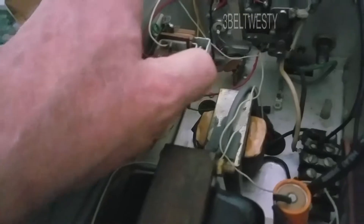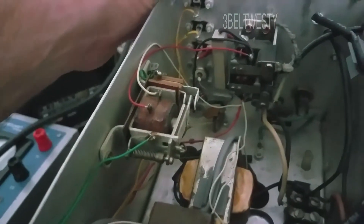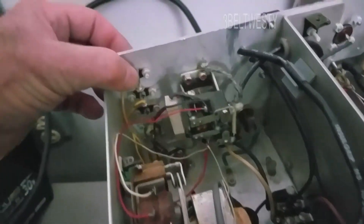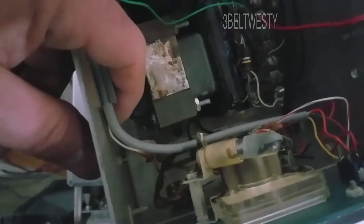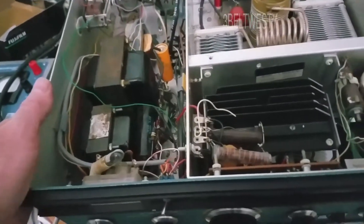I'd sure not call that the transmit/receive relay for the RF with these long wires - looks like it's still connected right here, input to output. Got ALC relay - and that's hooked up. Now the tube that's down in here is gone - there's normally a tube in here for the old relay for tube units. He's removed that too. So it's a complete unknown.